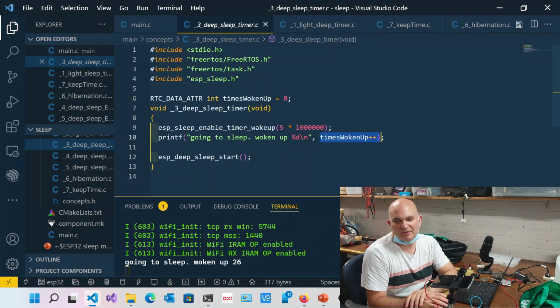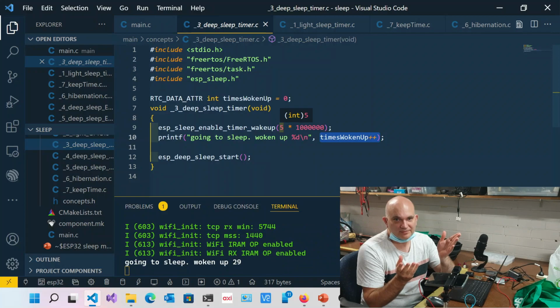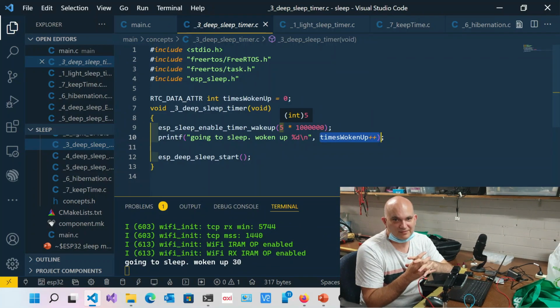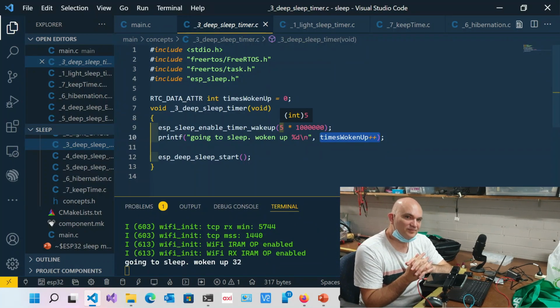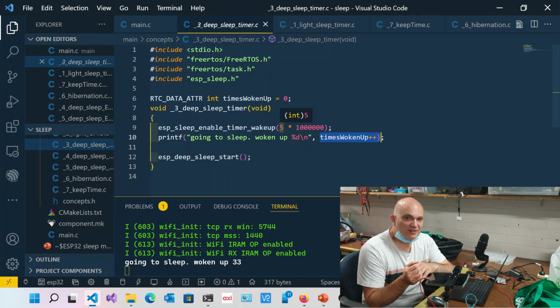If we think about it from our letterbox perspective, you could sleep this for, let's say, 6 hours, switch it on, and check a sensor to see if something was sitting on top of a switch, or obstructing a light. I'm just going to throw a scenario at you, this is how I envisage it working. I would love it to wake up, tell you there's a letter there, but also tell you what the battery voltage is, so you know how much life you've got left. So it's saying, saw a letter, and by the way, your battery's got another 6 months to go. You know how to do that because we've done it before. You just have a voltage divider. Yep, but you've got to make sure you've got high enough values so that you don't drain your battery.